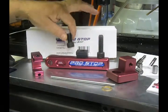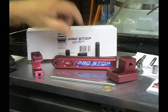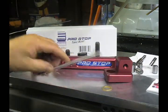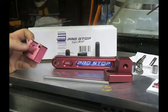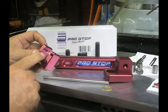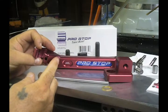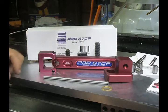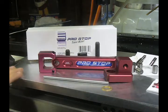Here are all the parts. They give you a short bolt, a longer bolt, a T-nut, the arm, the base plate, and the adjustable slider. You've got a hardened rod — that's going to be your stop. It all goes together really nicely. On the stop, it's a nylon-tipped set screw so it doesn't bung anything up. This is a very clever and handy tool — something you're really going to want to add to your kit on your mill.